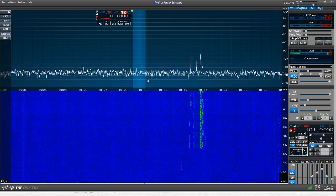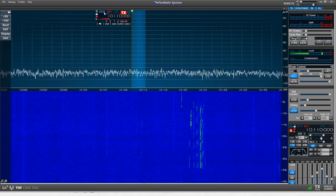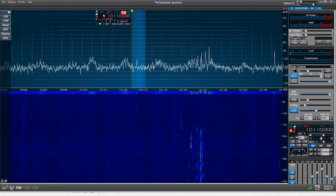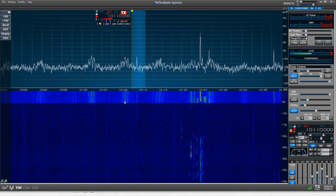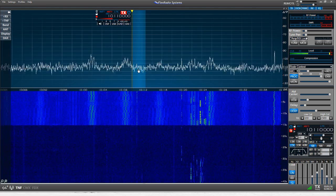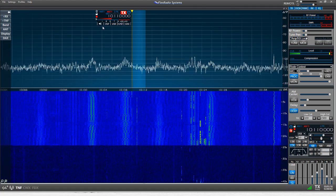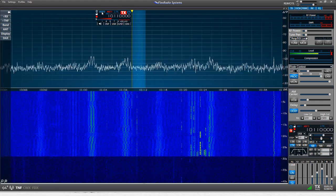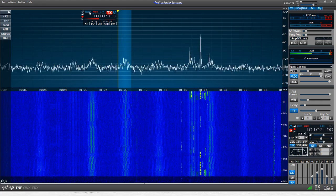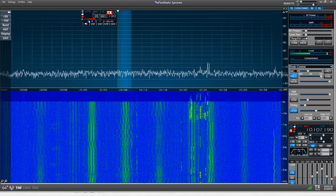The comparison antenna here is actually a fan dipole — a 30 meter fan dipole that also includes elements for 17 and 12 meters. It's a resonant antenna. Right now we're on the magnetic loop antenna — I'll give you a bit of silence, then switch to the dipole. Look at all that RFI come into play — yucky stuff. That plasma TV was a killer. My wife was always kind enough to sit on the sidelines and watch something on her iPad when I would operate because the plasma TV is a killer. And what's killing the plasma TV noise now is of course this magnetic loop. I basically told her to feel free to watch anything at any time, because this magnetic loop really wipes out a lot of that RFI. Amazing stuff.